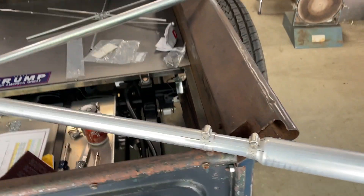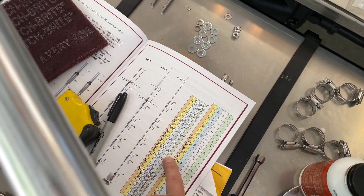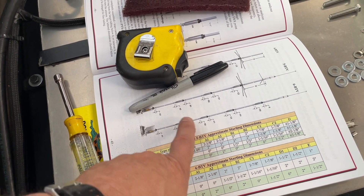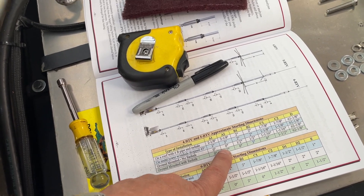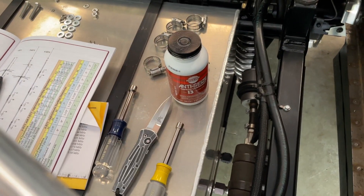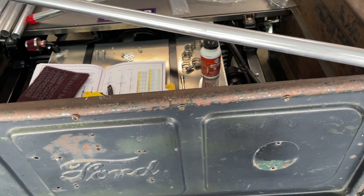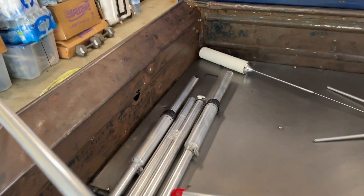This is the first pole — it's a 72-incher. According to the chart, with the radials the spacing is supposed to be two inches, which is position A2. I used scotch-brite to clean the connection and then applied copper anti-seize between the joints and got it all tight. I'm not sure how much I can actually build in the garage, but I'll start putting it together and run it outside. Here's the rest of my traps — that was my 10-meter trap.